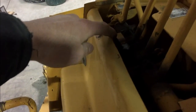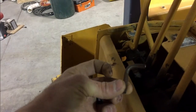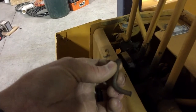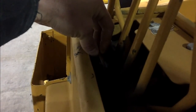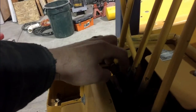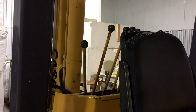What I'm going to do is reinforce this piece of metal so it hopefully doesn't break again. I've cut out a piece of 5/16ths cold roll, bent it at 90 degrees, and cut it off. I'm going to put it right here and weld it so there's a lot of contact area with new welds.